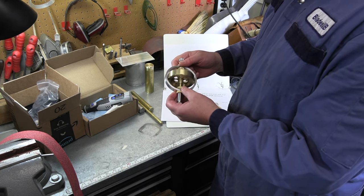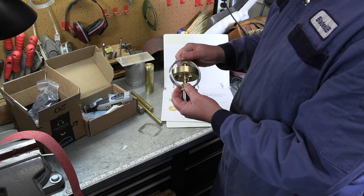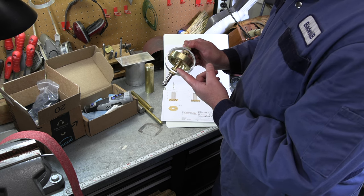So I'm pretty sure I've got some heavy drag. I thought maybe it was just bad bearings, but I think I'm actually just running that inner race on the backside of the brass. So I'm gonna pull this apart. I should be able to see if I've got some rub marks in there. I'll try to get a quick video of that.